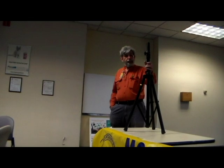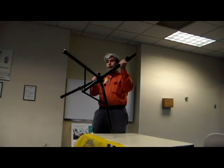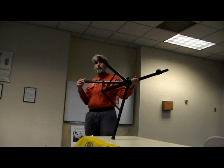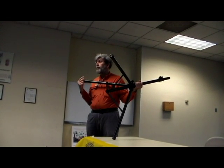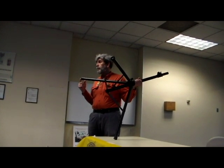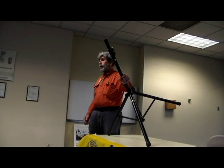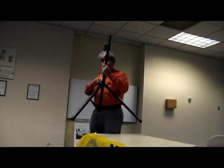One of the things about the MFJ tripods is that when properly adjusted, they give you a radius of five full feet, which means if you drew a triangle through the three feet, it's the circle that will fit inside that triangle — not the points of the feet — because the line between the feet is the place you have to overcome to tip the tower far enough to get it to tip over. So that circle is quite important.